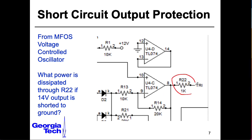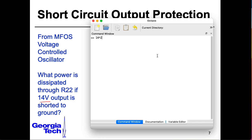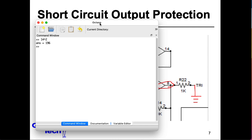Let's see what amount of power is dissipated across this resistor in something like a worst-case scenario. The circuit is designed to run off of ±12 volts or ±15 volts depending on how you set certain component values. The TL074 op-amp can't go all the way to the power supply rails at its output — it can get probably within about a volt. So let's say the op-amp was wanting to produce 14 volts and the output was shorted to ground. It's very unlikely that any of the circuits in Ray's catalog are actually going to try to put the full possible voltage out and hold it there, so this is a worse-than-worst-case scenario. 14 volts squared gives 196, divided by 1kΩ — I could interpret this as milliwatts, so that's 196 milliwatts. That's less than 250 milliwatts, so it's within a quarter watt.